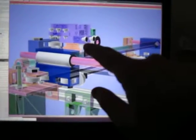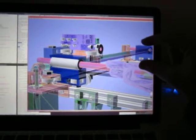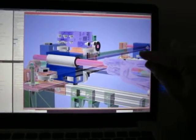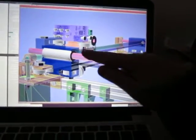That I put down there, but that bearing there, that bearing which is for the belt coming in, would actually end up hitting this rod. So that's why all of these are this weird shape. Previously I had it, I think it was 25 millimeters, so I've increased it to 35 millimeters. When those bearings were there, the belt path would bash and try to go through the square rod.